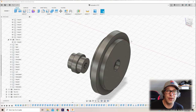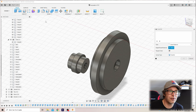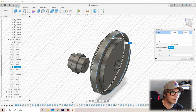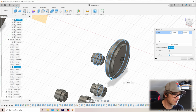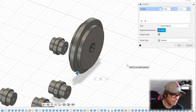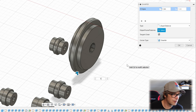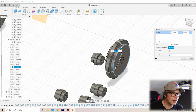We'll round off some of the edges on the rollers so that you don't have to do so much manual work after the printing. I think we'll do a chamfer. We don't want too much because we don't want the tracks to skip. Let's try 0.5, or maybe even one millimeter. Let's go 0.5, and we want a bit more on the outside for clearance to the undercarriage.